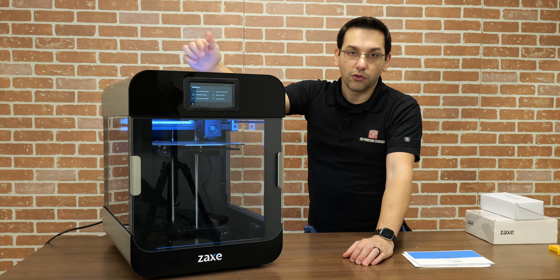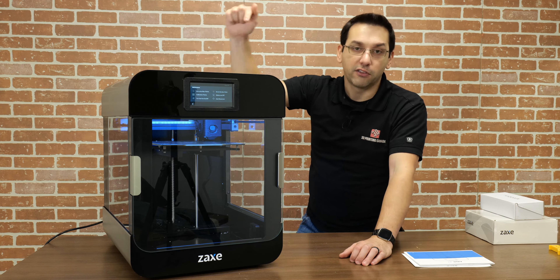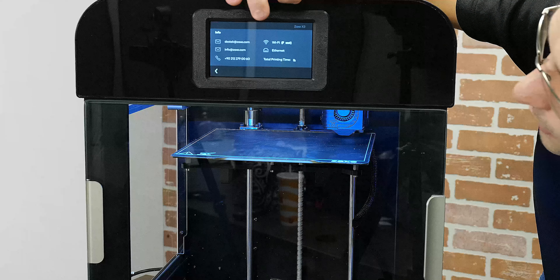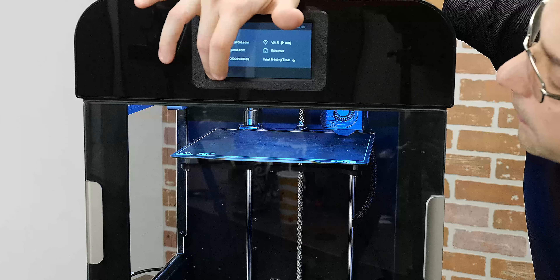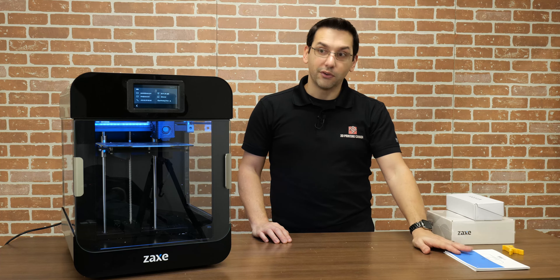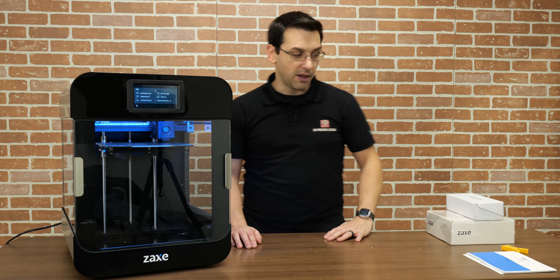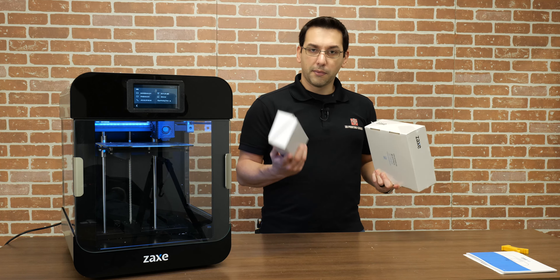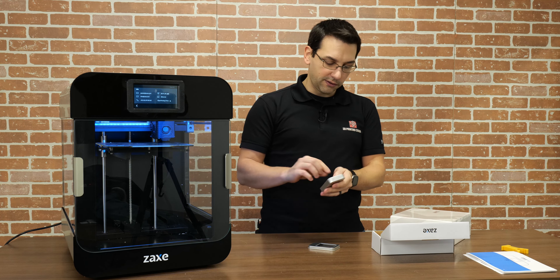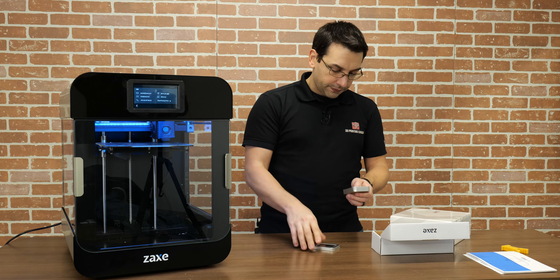Under Maintenance we've got Go to the Max Points — that's the kill switch at the bottom, so it's at max Z right now. Calibration Points — this is likely going to move to each of the calibration points, say 16 if it's a 4×4 or 25 if it's a 5×5, for fine-tuning mesh bed leveling. Actually it's doing the full mesh bed leveling — that's one of those cases where I should have read the manual. The electronics are using pretty quiet stepper drivers, probably Trinamic, on a 32-bit proprietary board they call the X board.